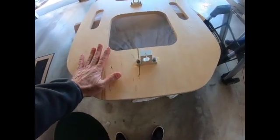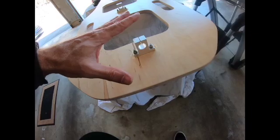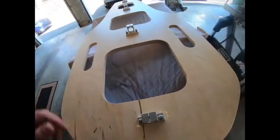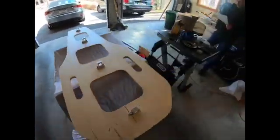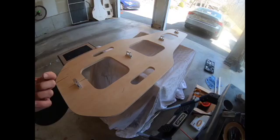So we have the holders for the rod — there's a rod that's going to run through here. This is the top of the bottom board; it's bolted up from underneath. You can see the bolts on here. There are four guides, and the rod's going to come through. Then the top plate will have springs that allow the forward and back motion, and it'll rock side to side. We've got the one bottom board done. A little trick a friend taught us: we took a toilet sealing wax ring and put it around all the bolts so that sweat won't go down into the holes — especially for someone like me with a serious perspiration issue. This is going to keep the wood from rotting where the bolts go through.